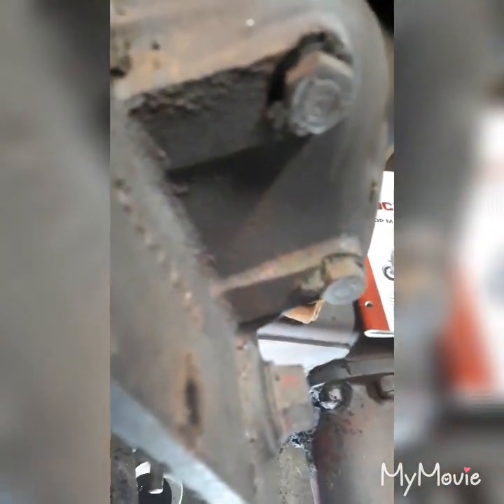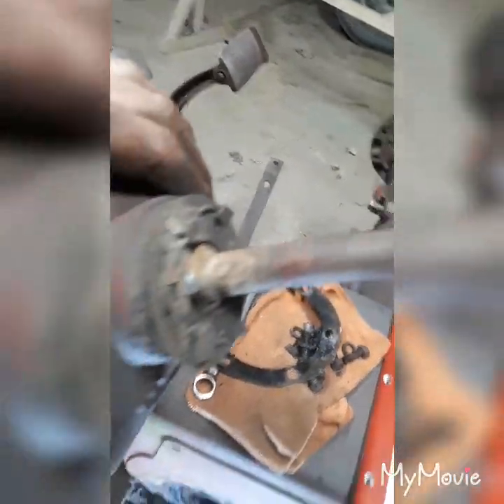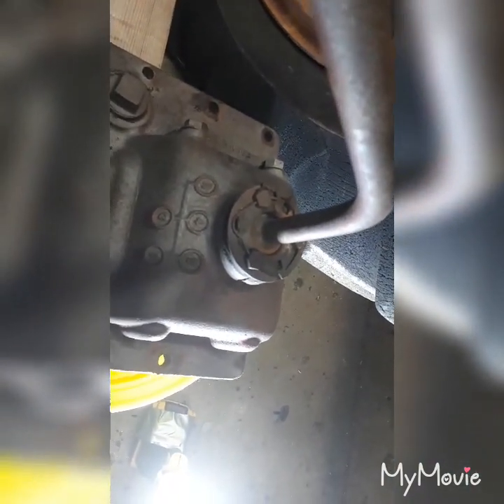There are clutch forks in there. I had to put my phone down for a minute because I didn't exactly know what I was looking at and I didn't want to look like an idiot. If all else fails, read the service manual. I can see how it turns. I can't get at anything underneath, so I've got to cut this wire here - there are three bolts - take that retainer off, and I think the shifter will come out the top because it doesn't come out the bottom.